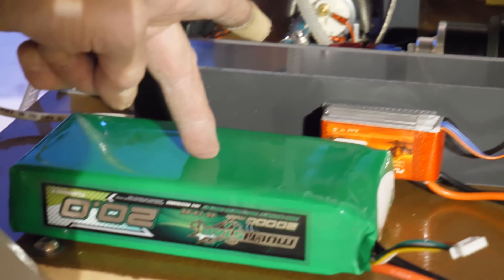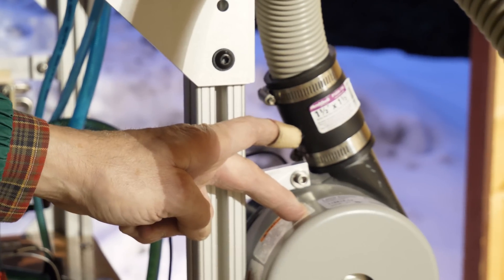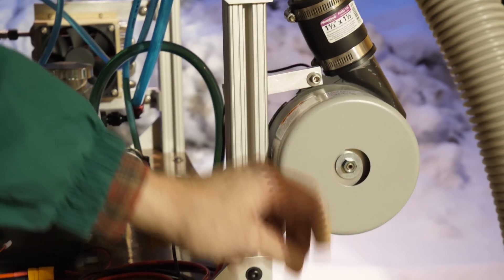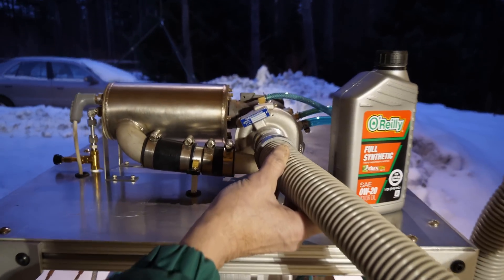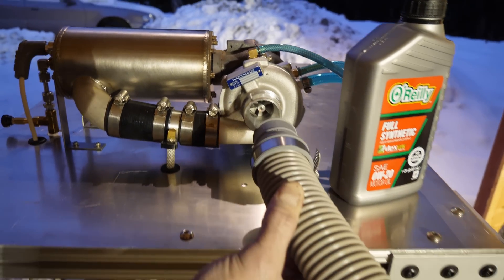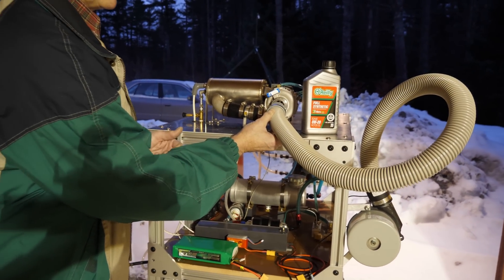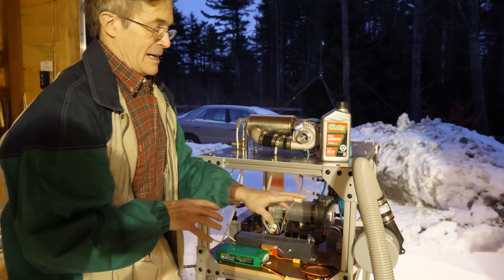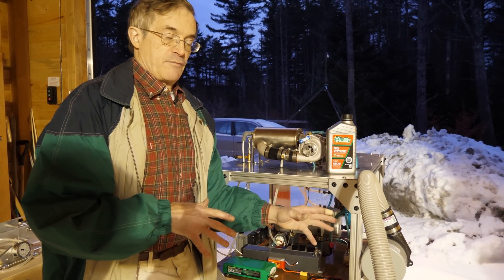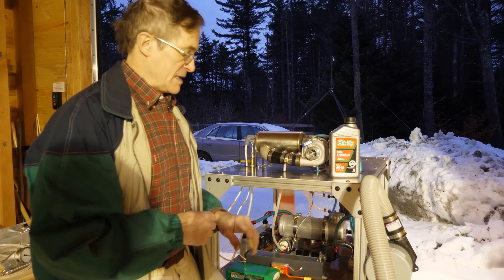In addition to that, you'll see a battery here that will drive a commercial three-stage vacuum blower. The clean air provided by this blower allows us to start the engine up, as well as to run the engine for a little while after the fuel's out, just to make sure that everything is cooled off quickly. That's a lot more convenient than using a leaf blower or something that may have debris in it — you don't want to get anything nasty into your engine.